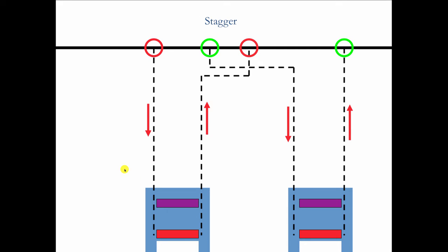And by the way, if you're looking at an old-style 1950s convector and you think it looks old, and you're taking it off the main like you see here, and you decide to put in baseboard, you may not get any flow through that baseboard, because if you put in 30 feet of baseboard or so, you're adding that much more resistance to flow than you have here. So these are supposed to be spaced the width of the radiator apart, and you got to keep the pressure drop through the radiator to a minimum to induce flow. If it's not heating, chances are there's no flow going to it. It's not air.